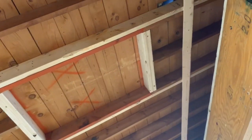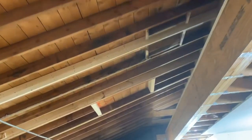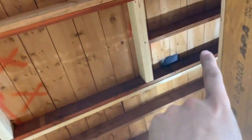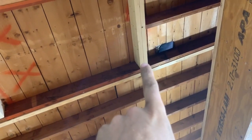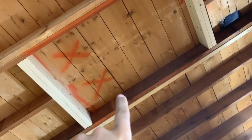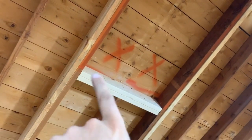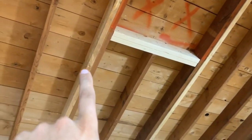Framing complete. That's my sister piece. You probably saw the time lapse of this. So basically we have a line that I put up there with a laser, measure down to where we want our window to start, and then work backwards for those two, work down for those two. Rough opening is 30 and a 16th by 45 and 3 quarters — it's a little bit wider than what we need, but that's just because we're using the original rafters. And then there's our sisters.